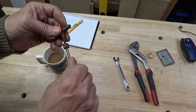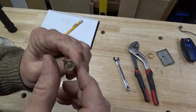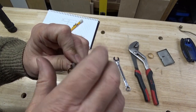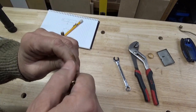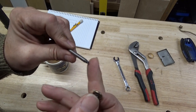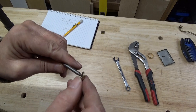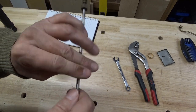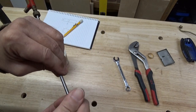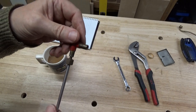So what is going on? Well, this little wheel may be the culprit. As I think I am turning to open the valve, what I'm actually doing is turning off the wheel — it's spinning freely on the shaft. So it may be as simple as putting a little Loctite 542 on this thread, letting that set up, and making sure the shaft is not too tight with this capture nut here. Then the valve should be able to open and close as long as I don't super-tighten it.